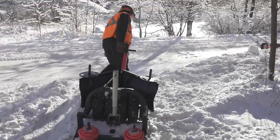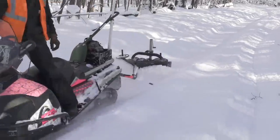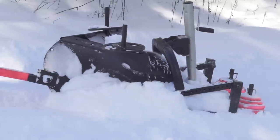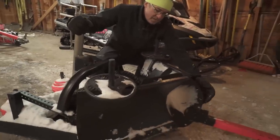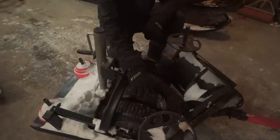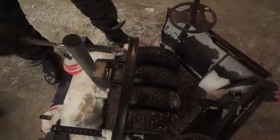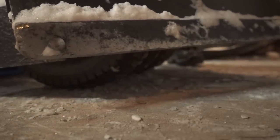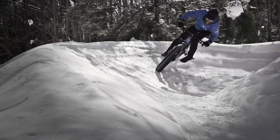What we have here is your now-traditional v-plow. This is going to open up your trail quickly once you have a firm, packed-down trail system. The v-plow simply removes light fluffy snow off the trail. What we did is took a four-wheeler plow, cut it in half, welded on this disc with multiple attachments, then added this packer to it — just some lawn tractor wheels and a trailer jack that raises and lowers the wheels, which raises and lowers the plow. You can finely tune it; we can raise the plow so it's not digging into the edge where you're trying to ride.